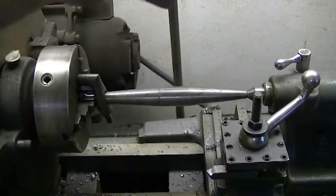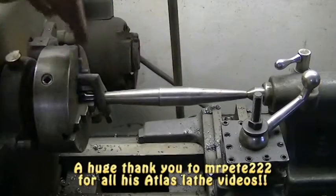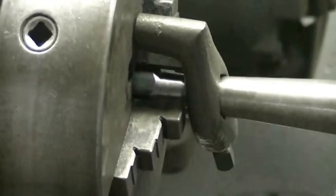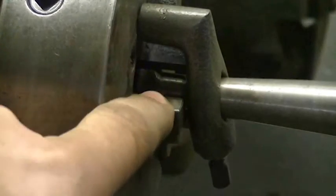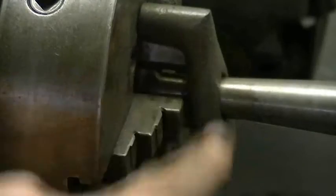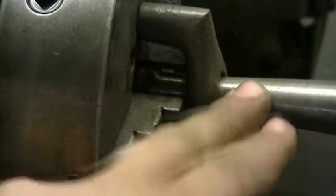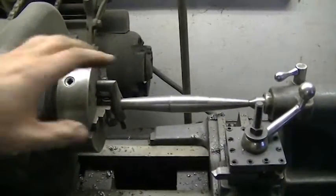Here are the end results. I've managed to get the shaft suspended between the two centers — the tailstock center being factory made and the headstock center being made by me, which I am not bragging about because it's not done properly, and I'm not even using the right kind of steel. I just needed something to get me through this cut. I had to move the center further back in the chuck because if I put it out as far as I wanted, the lathe dog wouldn't reach the chuck and wouldn't engage the jaws. The lathe dog is something you attach to the shaft you're trying to spin — without it, the shaft will just slip when you touch it with the tool. The lathe dog transfers the power from the jaws to the stock so it will rotate.